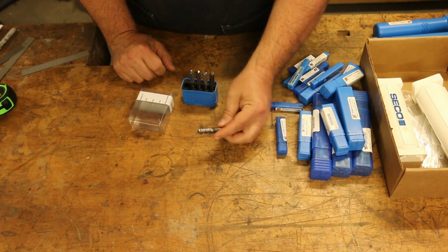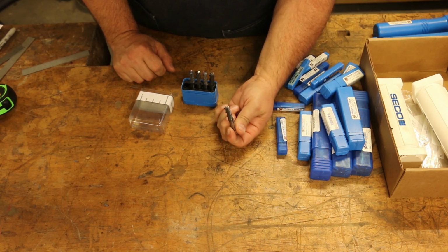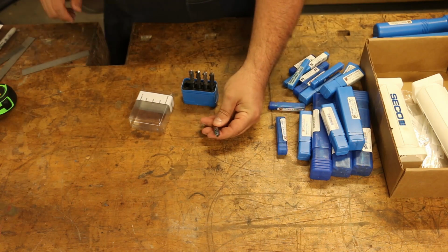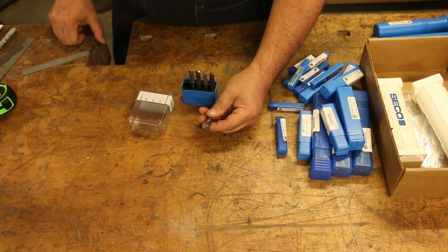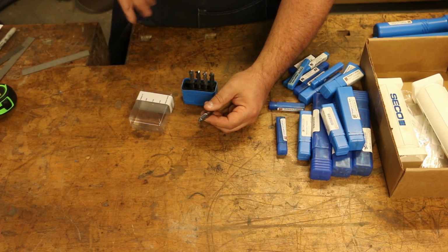This one has a patent number on it, and this is actually for a patent that Dennis has. This is one of his creations, and it's quite a unique end mill in how it was designed. It was designed as a general purpose end mill, but one just for running at very high speeds, probably mostly in CNC equipment. But one common problem you have is you get chatter when you run these. So you get a little vibration or a little harmonic going on, you get at least some marks on there.